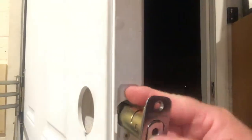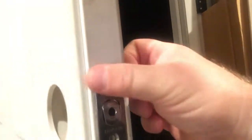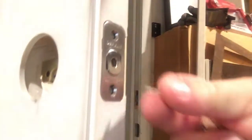If you just have any door from a hardware store, it's going to have this recess already there. Otherwise, just draw a pencil around it and use a knife or a chisel. And you might have to bonk it in with a mallet. Or if you don't have a mallet, just use a little piece of wood, a couple pieces of cardboard, and just bonk it in with your hammer. Super light. You just want to make it flush. Then go back to your screws that you laid out in order, right? And there you go.